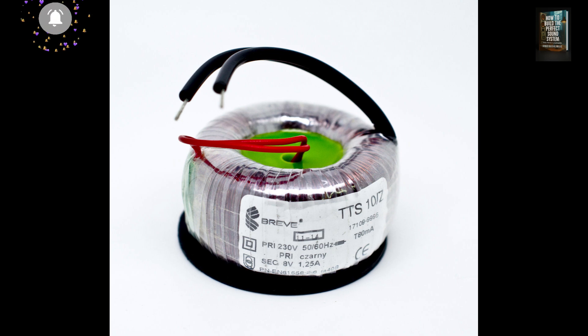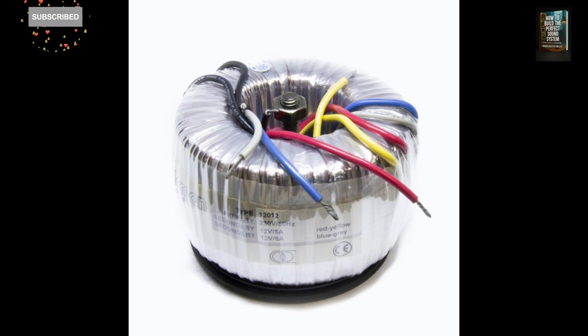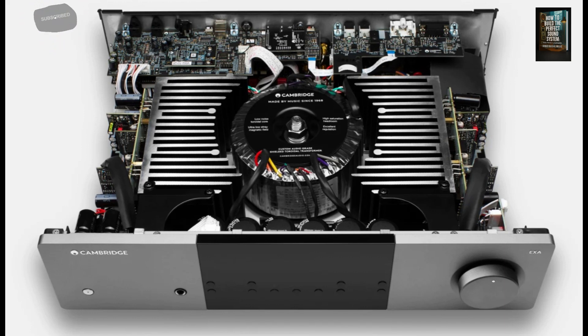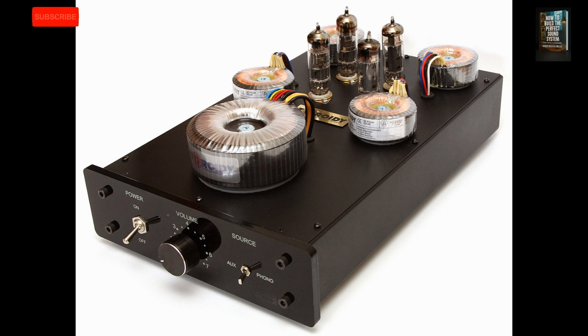What's the most important thing you need to understand? It's actually pretty simple. An electric current generates a magnetic field. A changing magnetic field can induce a current in another conductor. If we wind that conductor into a coil, we greatly enhance this interaction. And if we also use a specially designed core, that magnetic field is concentrated and directed more efficiently, maximizing the process. Transformers always work with alternating current, AC, because the magnetic field needs to be constantly changing to induce electricity. This is exactly what Faraday's law explains.